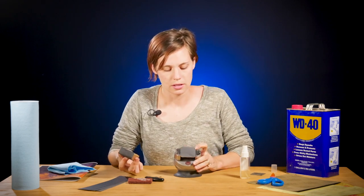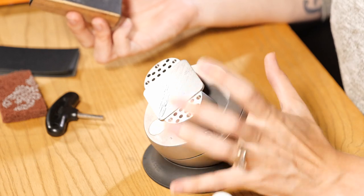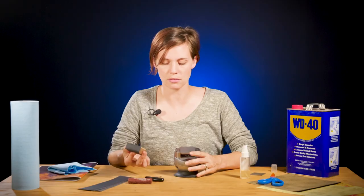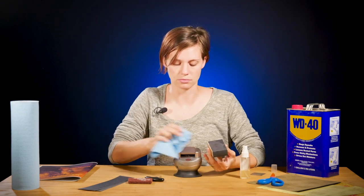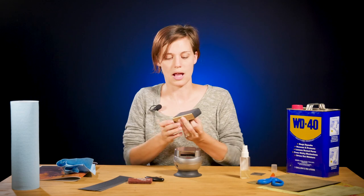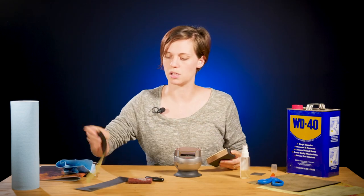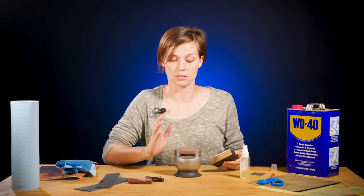As you can see, the WD-40 and the grit from the sandpaper on the metal creates a residue that makes it hard to see if you've gotten all those scratches out. In between, I'm just taking a shop paper towel and wiping that off to look at it from different angles and make sure I've got those heavy scratches out. Once I work through this, I'm going to go up to the next grit, which will be 320. This definitely takes quite a bit of time, but it's worth it — you want your engraving to be on a good surface.